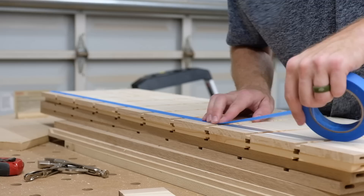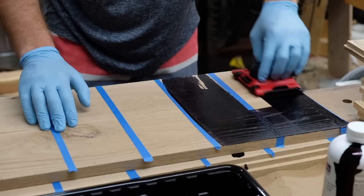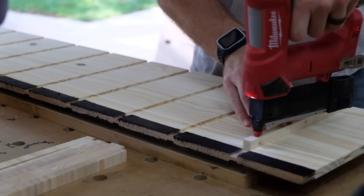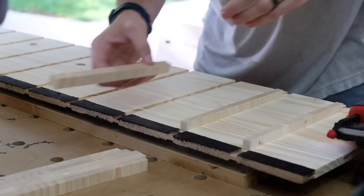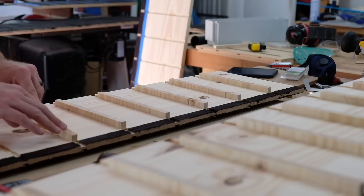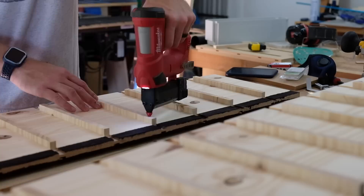The white oak on this cabinet will be dyed and stained a jet black, so I need to get that done on the internal faces before moving forward. Right here I'm using a jet black dye by Mohawk — this stuff is super thin and can get everywhere quickly, so don't wear your new bathing suit when applying this. In an effort to save weight, I decided to try using runners instead of full-width dividers. I'm gluing and nailing pine strips into the dados, and then later I'll come back and add the front and back horizontal dividers. These strips have the same grain alignment as the panel so wood movement will not be a concern. In the end, I estimated that this saved about 10 pounds of weight.